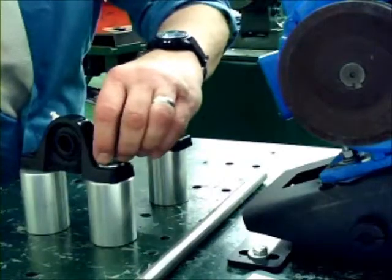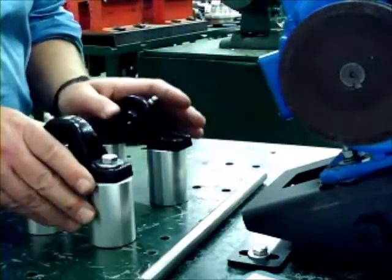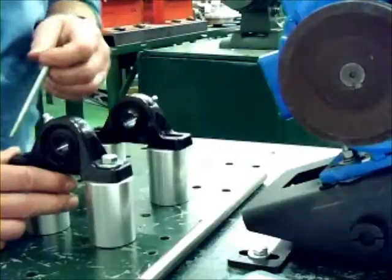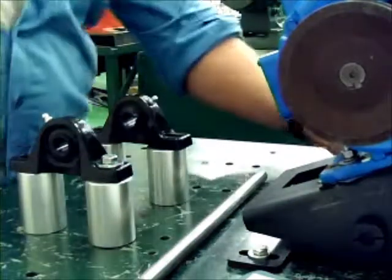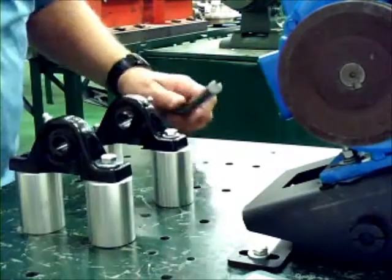Again, maybe back off half a thread so that you still have some movement area, because we still have to line the shaft all together with the motor shaft. And I would go ahead and proceed to do that with the rest of the hardware, dropping the bolts in, and from there we'll progress with the shaft.